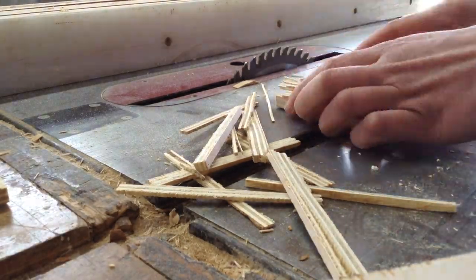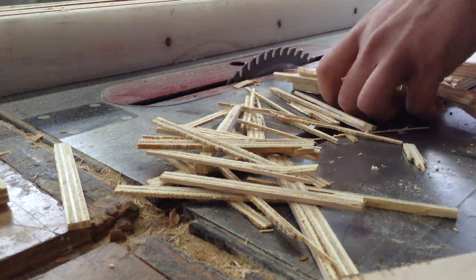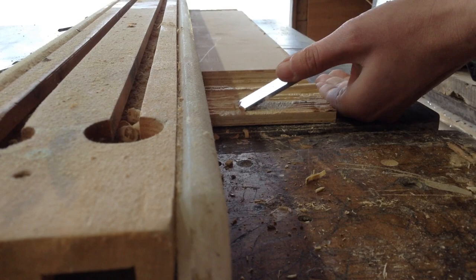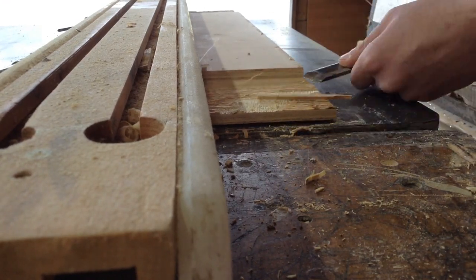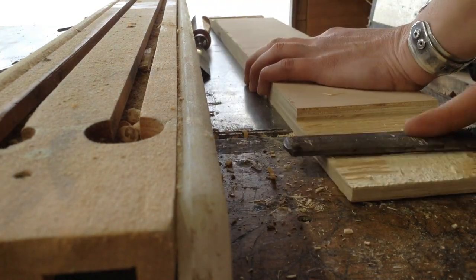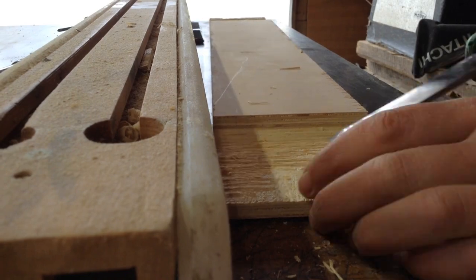This is just four-inch wide strips of plywood that I cut laps into on either end on the radial arm saw. My hand was in the way for filming that cut, which is why there isn't a long segment of it. I just cut laps on all the ends halfway down the piece, cleaned it up with the chisel, and then glued this together to make a rectangular base.